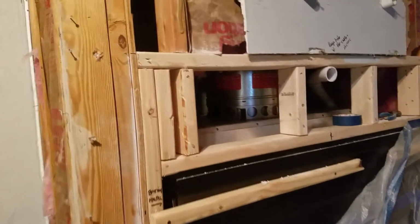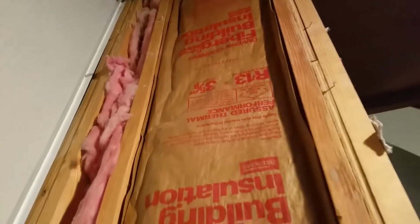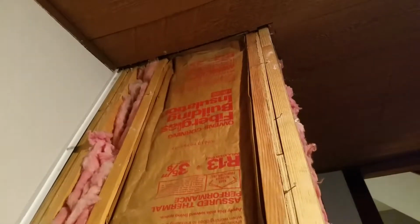And then as we're taking the drywall off, I notice a little bit of a problem with some of the studding. So that's not what you want to see. So we have that going on, and then over on this side, it goes up to the wall. You can see the movement in that. It's probably, I don't know, 3/4 of an inch worth of movement. So we'll get up there, see what's going on with that, remount it, and reinforce this wall before we put any backer board on there. But everything's looking good so far.